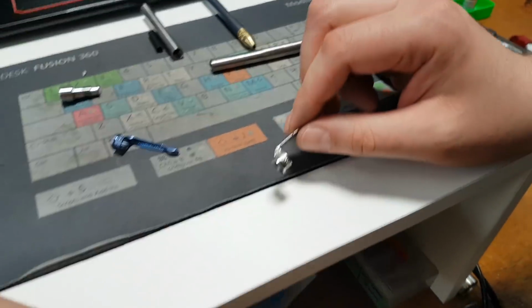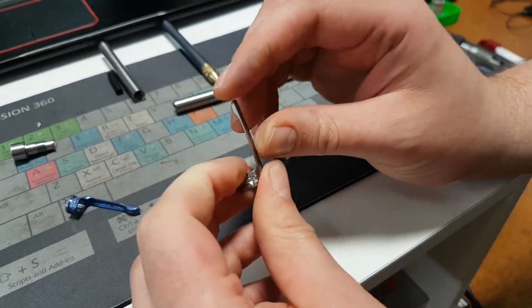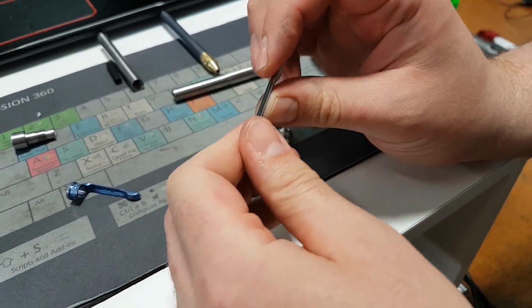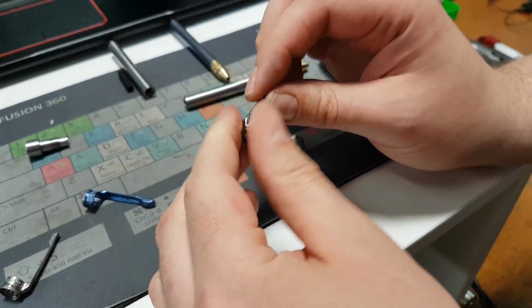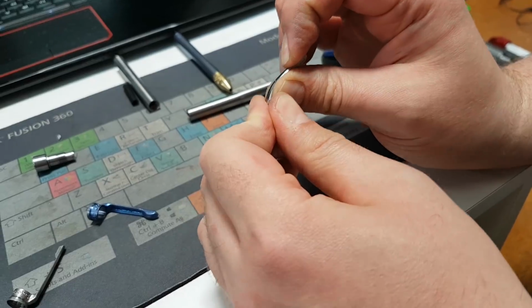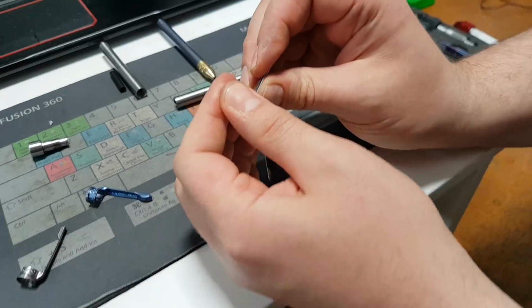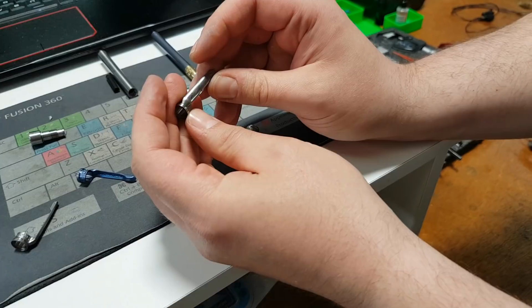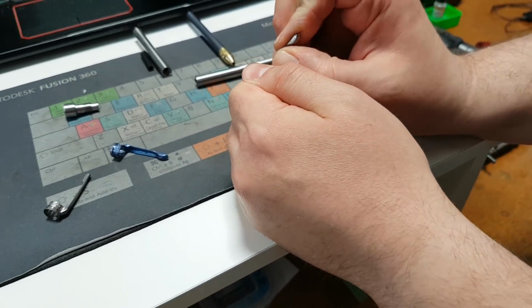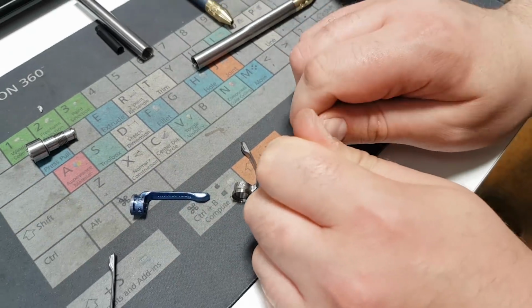All right. Bending test. This is CP titanium. Let's do this first. Okay, that's 6Al4V. You can spring it, but you can't really put a kink in it. It takes a while to spring back. And the CP titanium has hardly any spring back. So let's leave it bent so that we know it's a bad one. Absolutely no spring back on that.